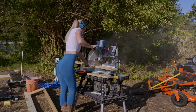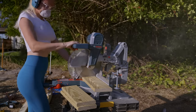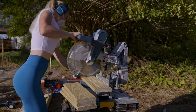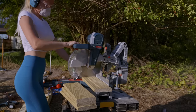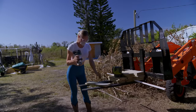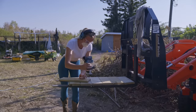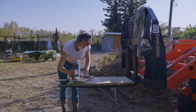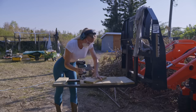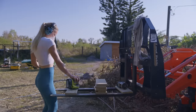Here I'm cutting the slats — 14 of them exactly. To make the pieces look cleaner I used my hand router to rout over all the edges. Once I routed over all the edges it was time to smooth out all the pieces, so put on some good music and have some fun.